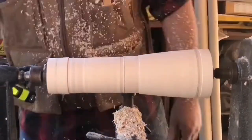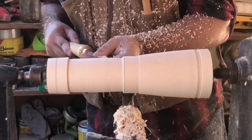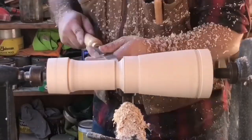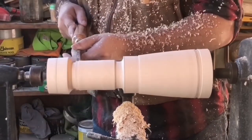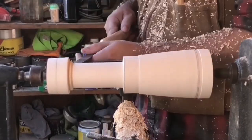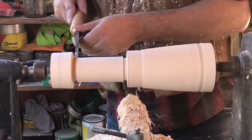Right now I'm isolating the handle part from the rest of the mallet. Here I'm actually spending time practicing — I'm not going straight to depth. I'm going down with the parting tool to a certain depth and then trying different ways of straightening it out. I use the skew chisel to remove material, or the roughing gouge to remove material, and then the skew chisel to straighten it out. I tried different combinations of tools to see what worked best, but the spindle gouge to remove material and then the skew chisel to clean it up ended up being the best one.